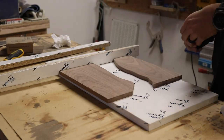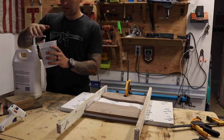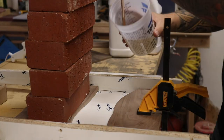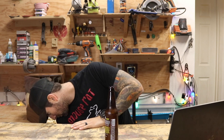The hot glue wasn't the problem. I had to pour this mold three times because I rushed it, and I was also experimenting. I reached out to TotalBoat and they said I should have used their thick-set epoxy instead of just their standard two-to-one or three-to-one. The thick-set has a much longer open time before it starts to harden, which allows the bubbles to pop. I sealed the underside where the walnut met the Tyvek or the melamine board with hot glue, so even if epoxy seeped all the way underneath the wood it wouldn't have escaped.